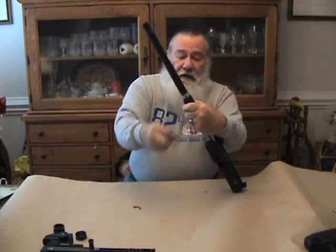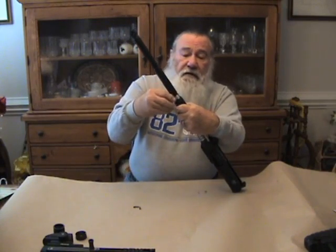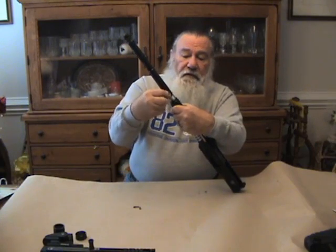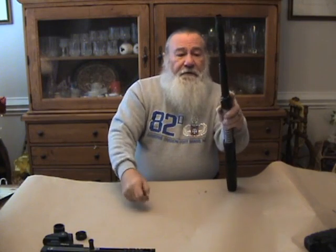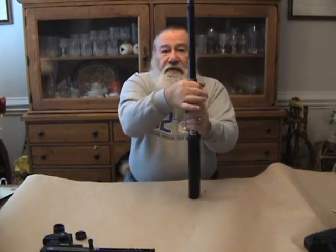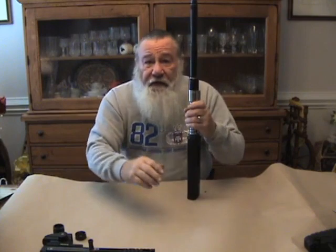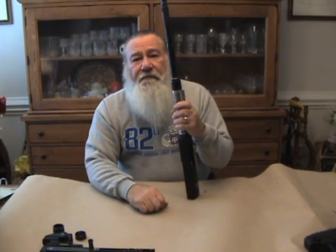So when you put it back together, which we'll do, but I'm going to show you it right now anyway, there's a little indentation there. This is fun. Hold it with one finger. Get the other one in on the other side. And now let your gas piston up. And you see how your shroud cannot go up now. It just can't go up. And for you guys sitting there going, I can't see that, watch this.